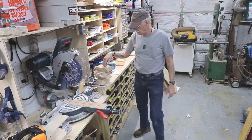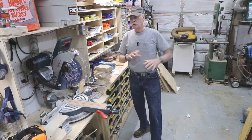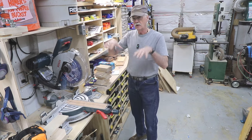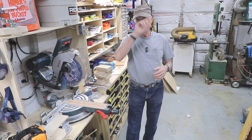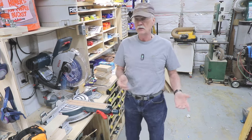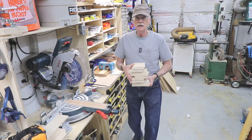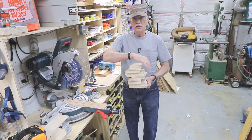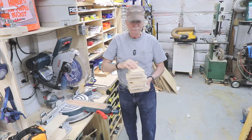I've got my sides for four boxes. The tops will come later — probably have to get another sheet of plywood to get all the tops out, because they're going to be six by six, thereabouts, to fit on top. When I glue these together and pin them, there's going to be a lot of glue in there, but I'm also going to put corner blocks all the way around on the inside to give some added strength. I'm not going to use splines, just corner blocks on the inside. So the next thing is to go ahead and cut the 45s on the ends of each piece, and one side here for the top. Back to the table saw.